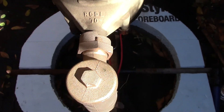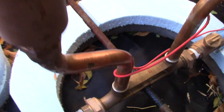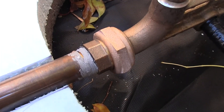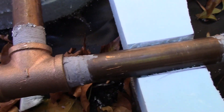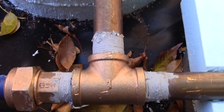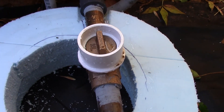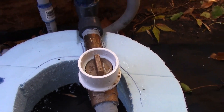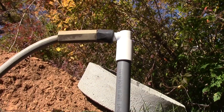You are responsible for everything on this side of your water meter. The hookup here uses a one-inch brass nipple coming into a brass T. The T goes over to a stop and waste valve, which then comes up this one-inch pipe to your sprinklers, a hydrant, or whatever else you would want to water in the yard.